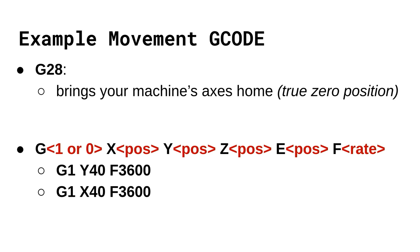Here are some practical G-code examples. G28 is a special one you'll most likely see at the beginning of a 3D print — it brings your machine axes home so that any movement afterwards starts from that zero position. You can make components move by sending G1 or G0 commands, providing X, Y, or Z axis as a parameter, and it will move in that direction. There's also a special axis E, which stands for the extruder and tells how much filament will get extruded out.